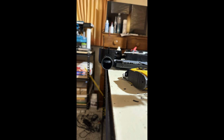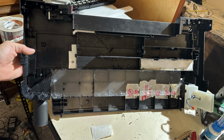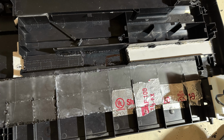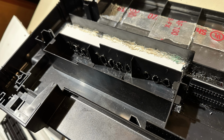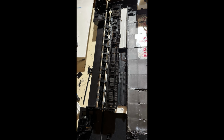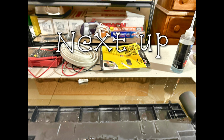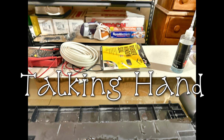First thing I had to do is figure out where that main vacuum port was going to go. Then put temp plastic in there, kind of figure out where I needed my vacuum to flow through, and then put in some other little cover pieces, put some port holes in to direct the vacuum and plug areas I didn't want to lose the vacuum. And after all that, fit the platen piece on and then figure out how to get that to seal down, which I found out the rubber seal stuff works very well.